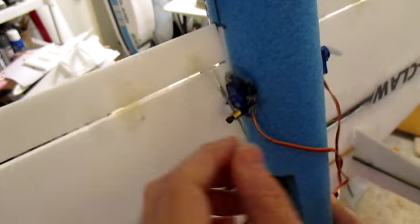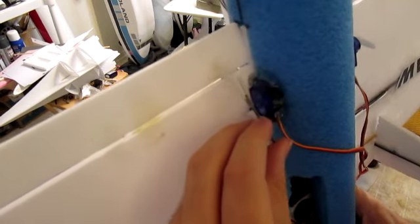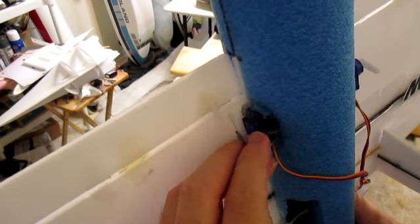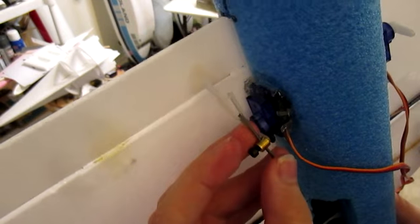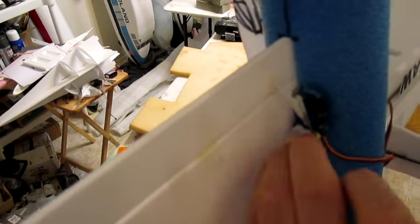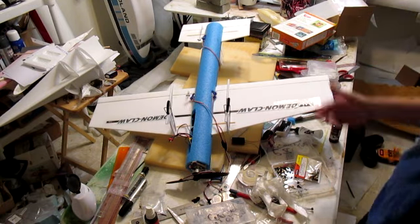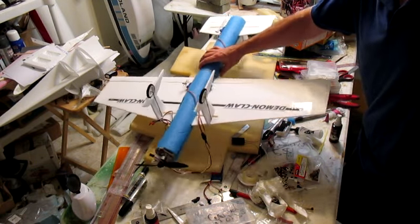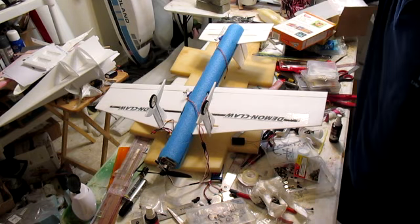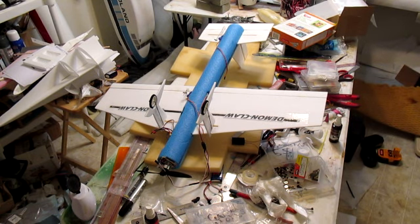Now the advantage of this is that you can loosen the control rod. You can loosen this and move the servo control rod and arm through the collet adapter, through the easy connector, and that just makes life a lot easier in fine-tuning the control rod and the servo horn and all that. It just makes life that much easier. Now, let's get in close to this action, and let me show you how I apply this part to your servo.